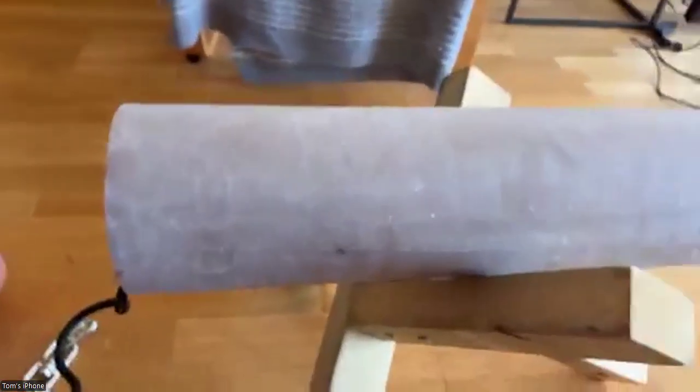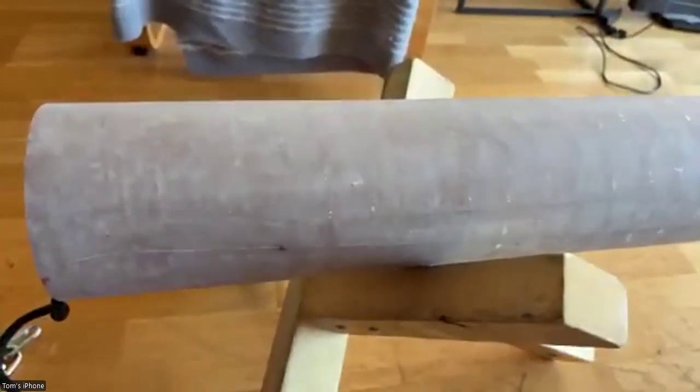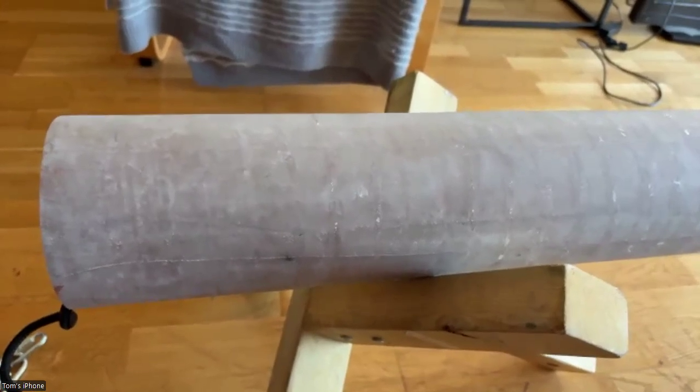Let's see where you've got your shock cord. So your second attachment point is going to be down inside. What's your shock cord made out of? It's a Kevlar shock cord, so the drogue is a 5mm Kevlar, which is 50 feet long, and the main is again 50 feet of 8mm Kevlar cord.